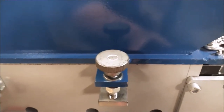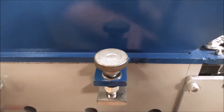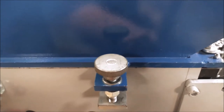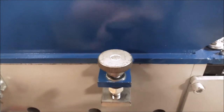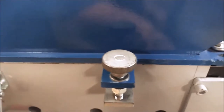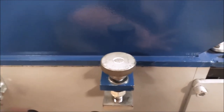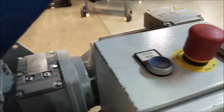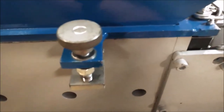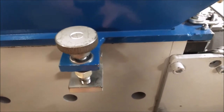Today I'm doing a monthly PM on all of our grinders. I've never done a monthly PM on these before — there's a simple instruction sheet, and I told my boss I would take care of it. I'm going to have to start doing this as part of my regular monthly PM. A PM is preventative maintenance — more or less you're trying to catch a problem before it happens. You're doing things like greasing, cleaning, changing filters, doing safety checks on things like this emergency stop right here or on one of the safety switches. You're also trying to catch something before it breaks or wears out.